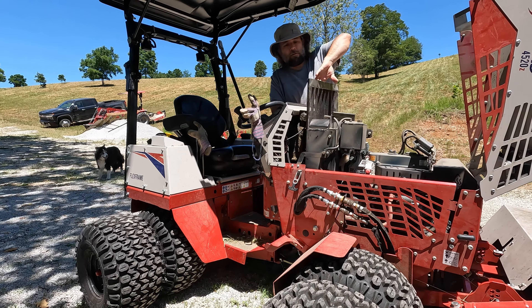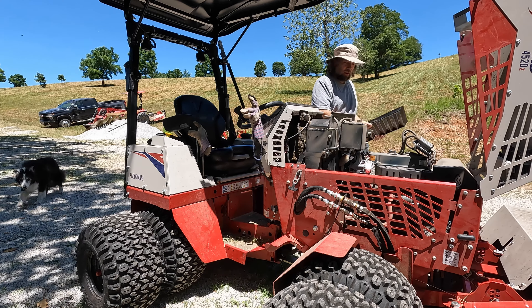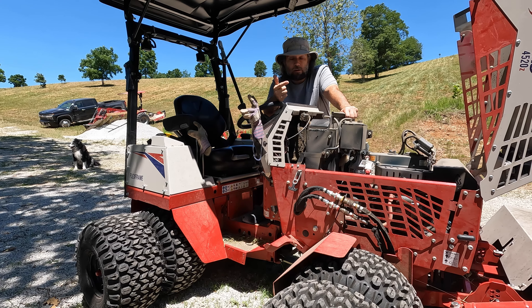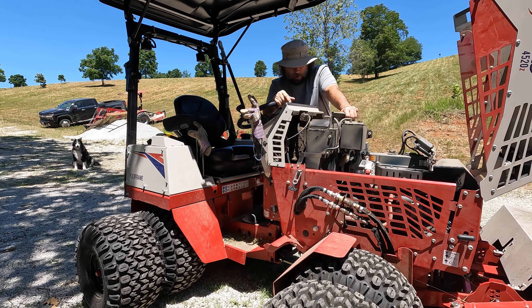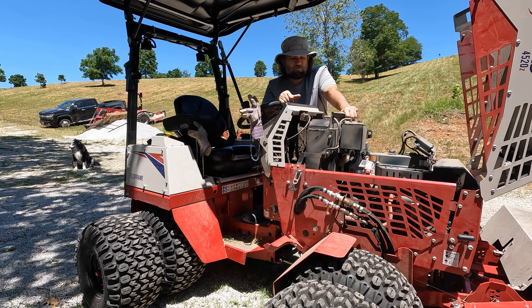We did have a very rough start. I didn't like the issues I had right out of the gate. Thus far: the hydraulic issue was fixed — it was a loose fitting. The seat had a safety connector that just needed to be clipped on a little tighter than how it came. And then my slope indicator magically fixed itself and hasn't come back. It's been 45 hours since I've had an issue with the slope indicator. It acted a little weird yesterday, but I was right at dusk and it was very dusty. Maybe the slope indicator had an issue with those three sensors being covered enough. It was weird — I was just mowing and looked down and it said it was in setup mode.